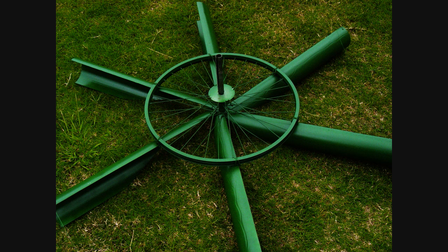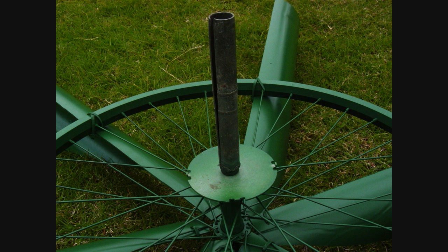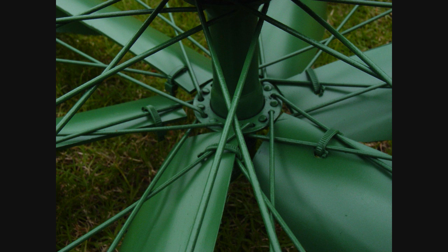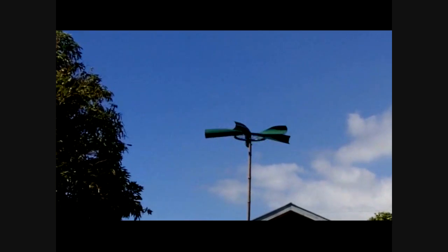And this has the bottom view. You can see I just welded a piece of pipe onto the nut that holds the wide bicycle axle. This provides a very good, strong support. These are very light so they don't need a great deal of support. A flat piece of metal could be placed in between the bolt and the nut, and it could mount copper coils, then put magnets on the wheel, and it could generate electricity.